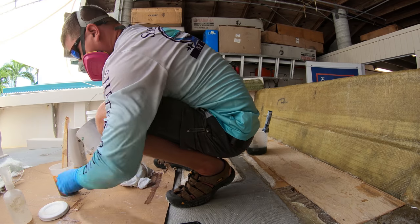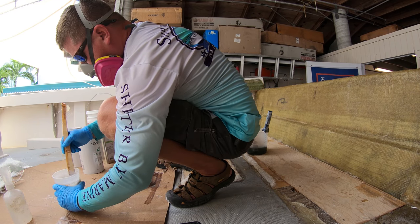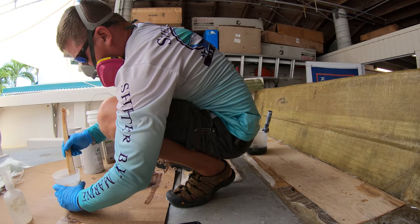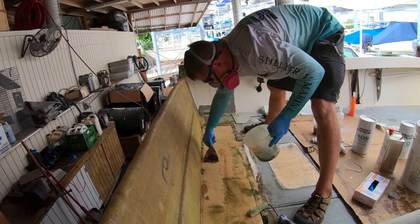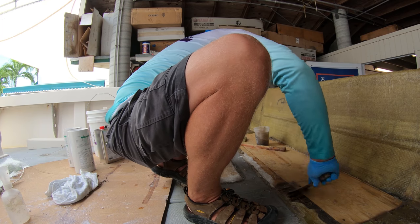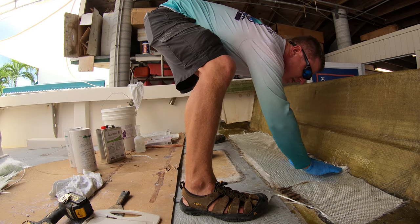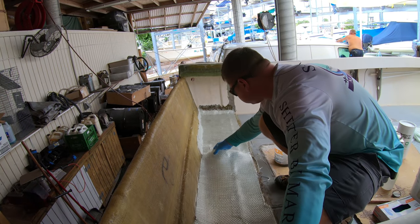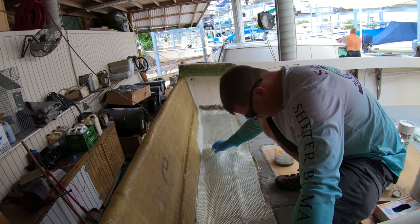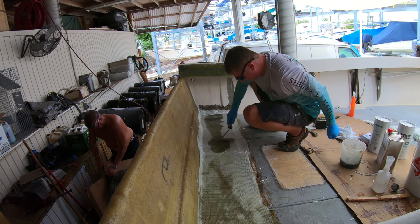We can then mix up some silica that we can push into all the edges around the floor section to fill in any gaps or broken sections of the existing fiberglass. Remember to be quick while doing all of this or else you will find that your resin has kicked off and will gum up while you are spreading it — and once that happens you'll have to scrape it all off. After cleaning that off we'll push the silica mix into all the gaps and roll out some fresh resin across the deck. Then we can lay down our bottom pieces of woven onto the floor, pour out some more resin, and work it around the pieces. Once saturated we can lay down the second layer of woven wrapping the pieces up the transom and gunnels a few inches, then continue pouring resin until completely saturated with as much air out as possible.